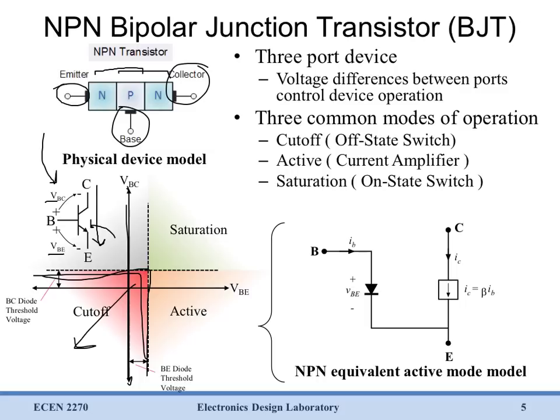If the base is at much higher voltage than either the collector or emitter — or both of them at the same time — we're going to be operating in saturation mode. In saturation mode our BJT is going to look like an on-state switch, so it'll look almost like a short circuit between collector and emitter. The third mode is the active mode, where the BJT looks like a current amplifier. This is what we'd like to use, because we don't want all of our current to come from our control signals — we want it to come through our BJTs from our voltage supply rails. We can do that by using these as a current amplifier.